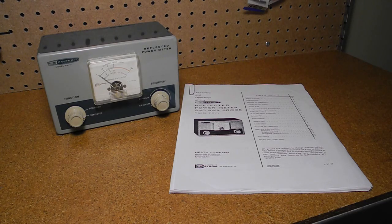I found a copy of the full manual on the internet. The manual says a power of at least 75 watts on 75 meters, the low band, and 2 or 3 watts on 6 meters, the high band, is needed for full-scale deflection. I found that my unit needs about 10 watts on the 40 meter band, where I usually operate.